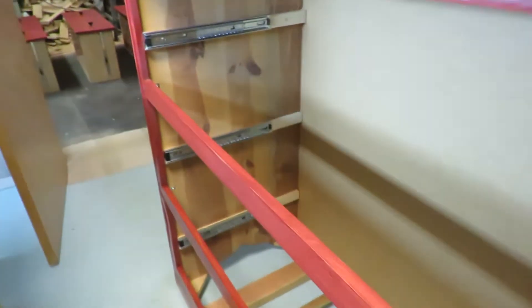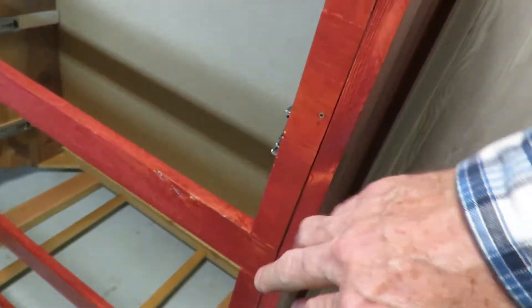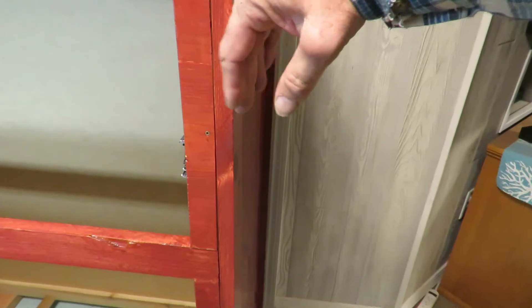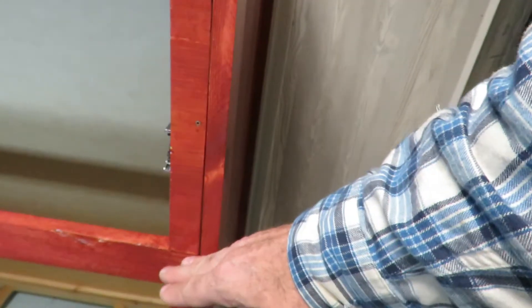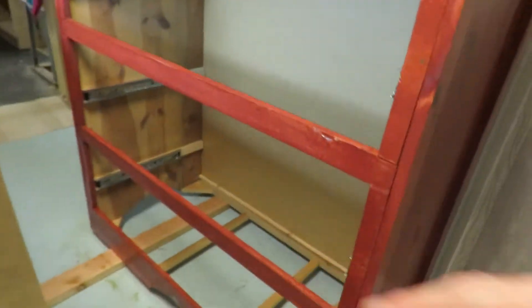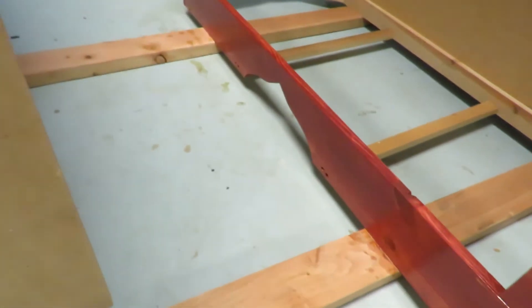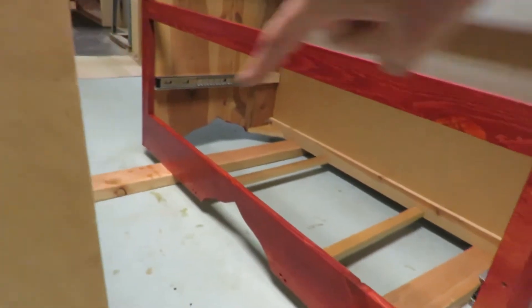I had some lumber — the same stuff I used to build the walk-in humidor on the walls — and I used one piece for each side. I had to cut strips and pocket hole jig them in. I had never used a pocket hole jig before. With a pocket hole jig you're able to screw in at an angle so the screws don't come out the front. You don't even see this because when you put the drawers on they come all the way out to the edge. I built this front panel all as one piece, did it by hand on one side, then copied it to the other side and cut it out with a jigsaw.